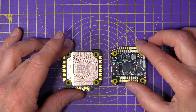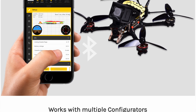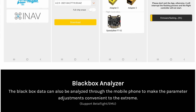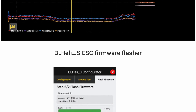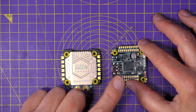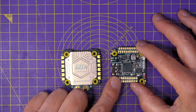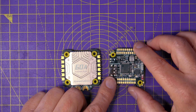This all talks to the SpeedyBee app using a combination of Bluetooth and Wi-Fi, so you can wirelessly set up your flight controller with Betaflight or iNav just using your phone — no USB cables needed. This makes PID tuning in the field quick and easy. I've been using the app since it first appeared and won't be without it now. You can even flash new firmware and change motor direction wirelessly without needing the BLHeli configurator.